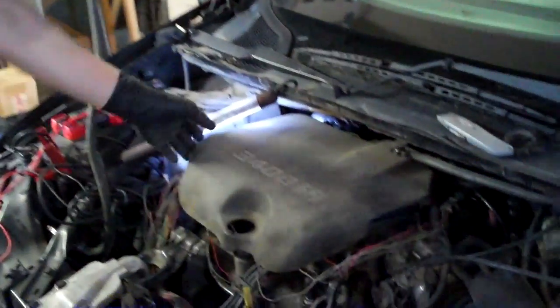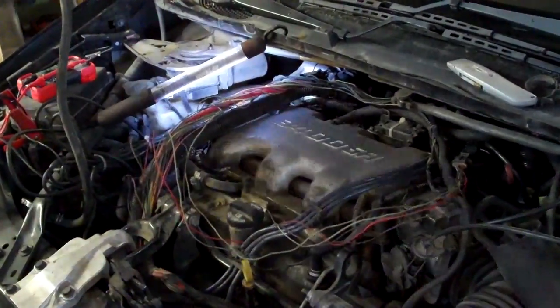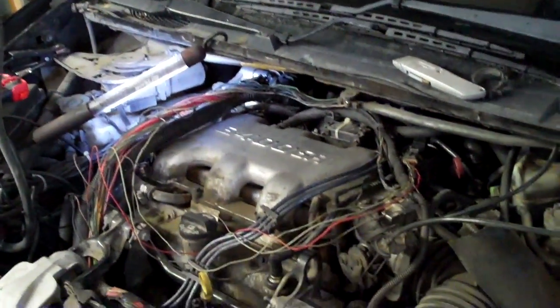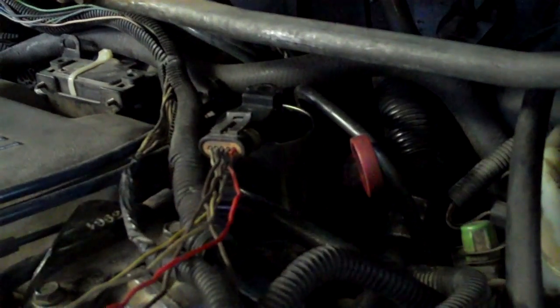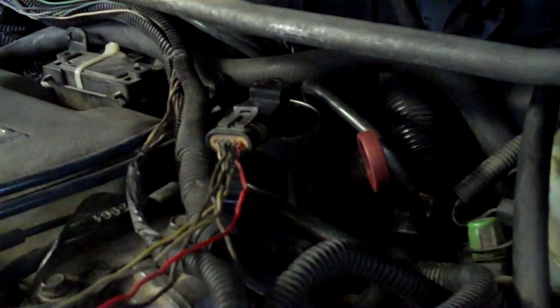Going on an EGR hunt! We pull off the cover and the other hood and peel off the little seal. Here's our EGR valve — it's back in here. We did just recently replace it. This van has 170,000 miles, and the most common cause for a P0405 is a bad EGR valve. I thought it was shorted internally, which is why we replaced it.